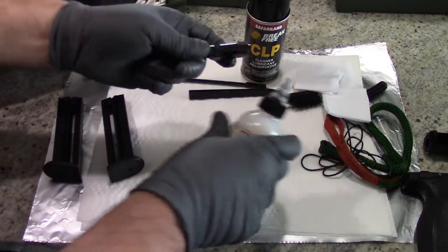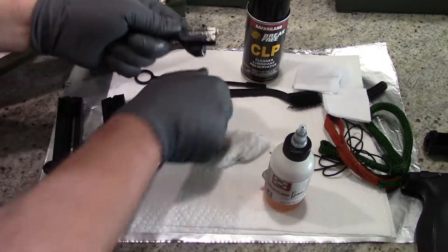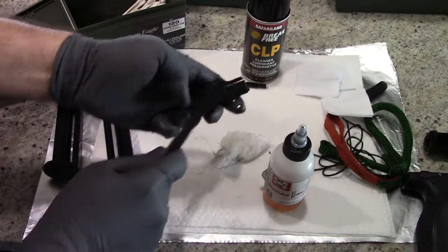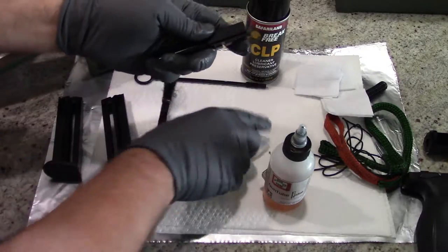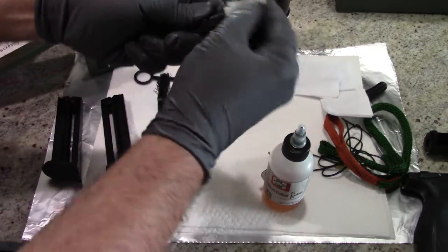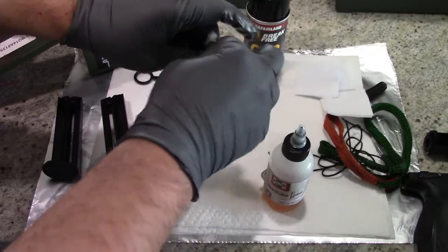Take your time. Just scrub it off a little bit. You can put a little drop of oil on the sides, then go ahead and hit it with the brush if you want to. An old toothbrush works just fine for this. Get all that grime out of there, then wipe off the excess. It's very, very simple — it's kind of nice having a basic gun like this to work on. They're not very difficult to clean, very easy to maintain and inspect.